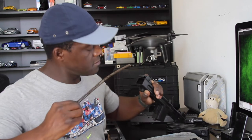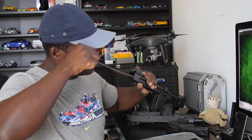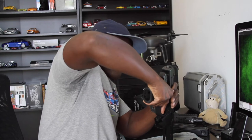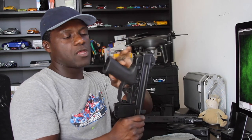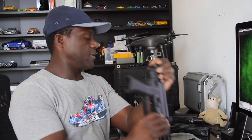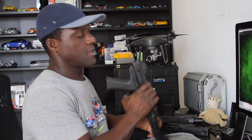I shot this today so it's not that clean. To reassemble: one spring goes inside the other, then run them inside here first, and control it — there you go. Trigger pack. One more thing — press this down, there you go. Now press down on this plate to make sure it aligns; there's a notch in the lower part of the receiver group that goes into the space accessible once you press the bottom of the plate. Now the pin goes from left to right straight. Fold it back to normal.